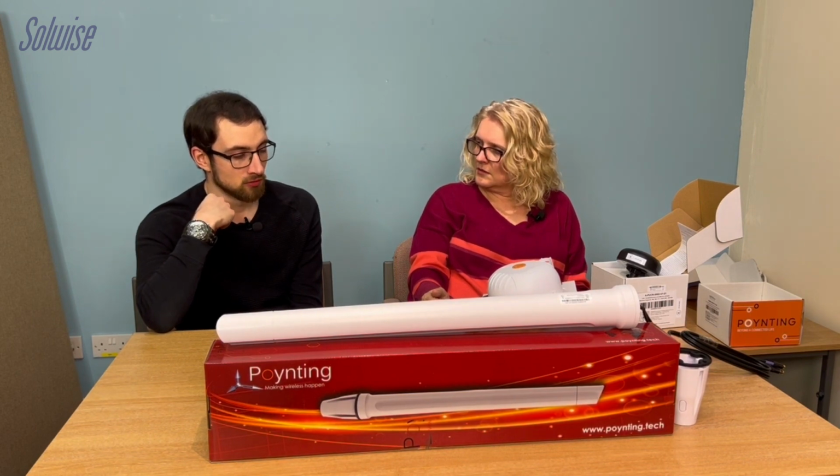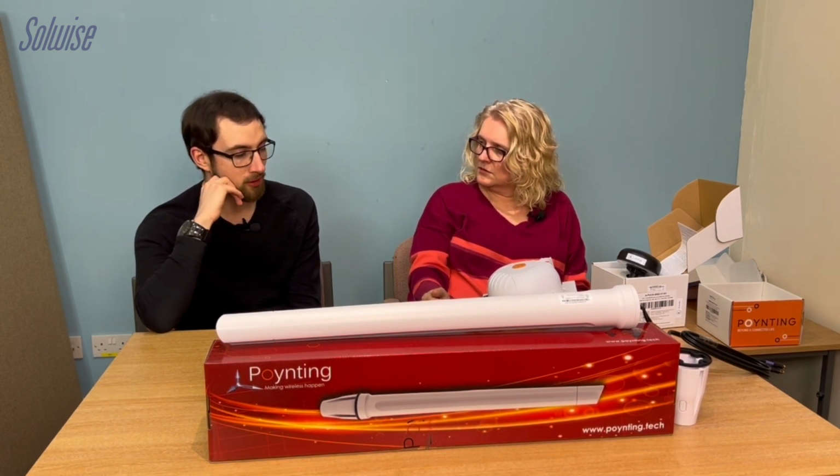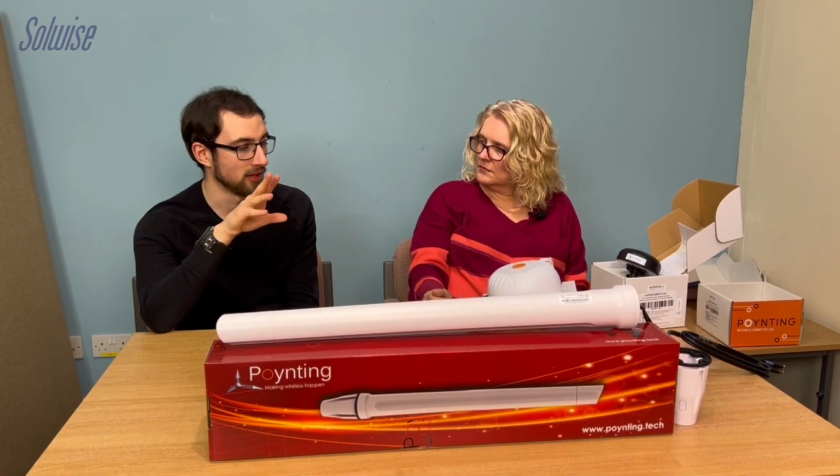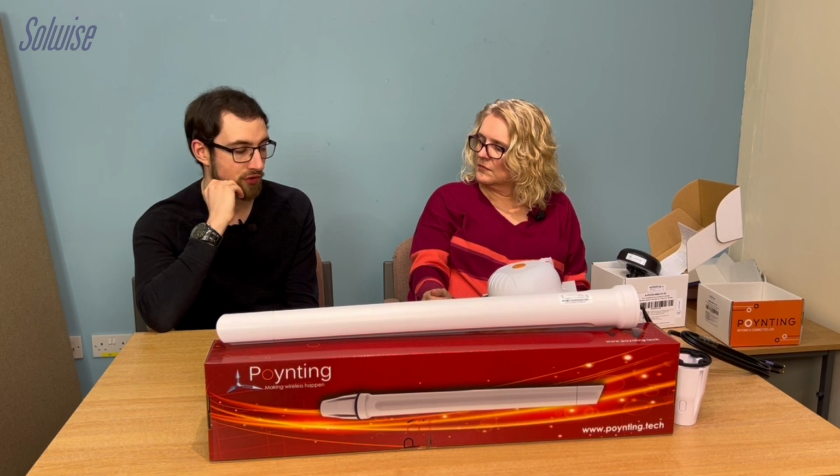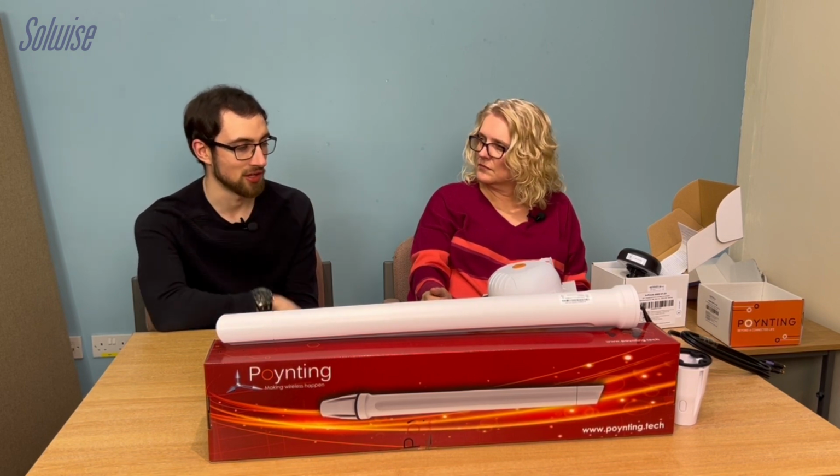And I suppose it depends on what you're going to use them for. So the MIMO 4, like the MIMO 3 range I mentioned, you've got different varieties. Some come with just mobile antennas and mobile cables coming out of them, and then some also have Wi-Fi and GPS facilities. So it just depends on what your router has and if you're planning to make use of it. Like you could have a RUTX14 which has 4 mobile, I believe 2 Wi-Fi. But if you're not planning to use Wi-Fi outside the boat coming from the antenna, you don't need to get the Wi-Fi side of things. You can just leave them unused and only use the mobile. Or just get the version that only has mobile antennas.